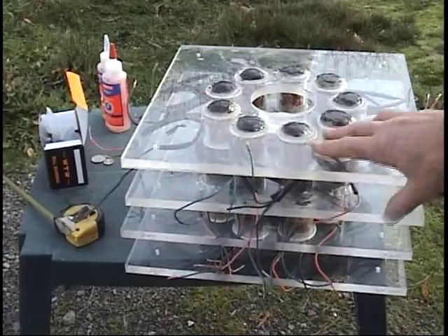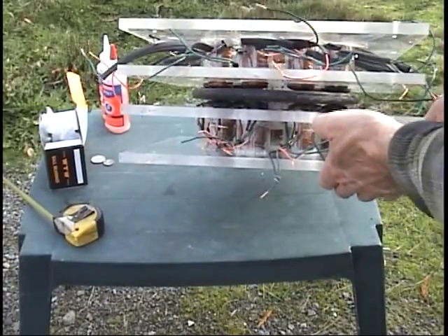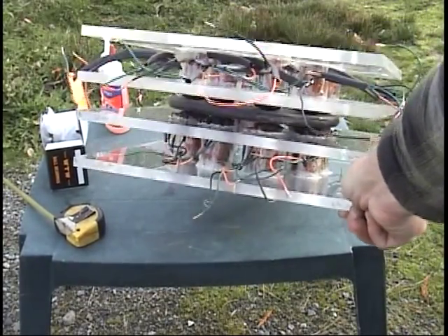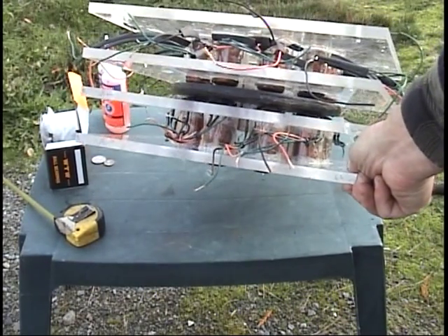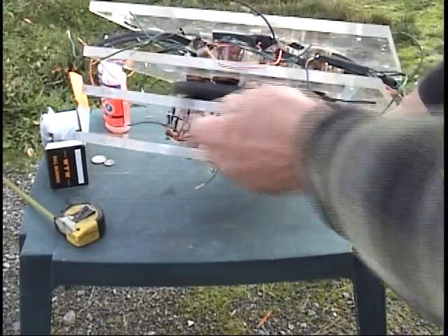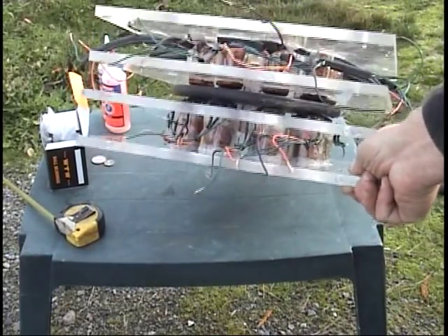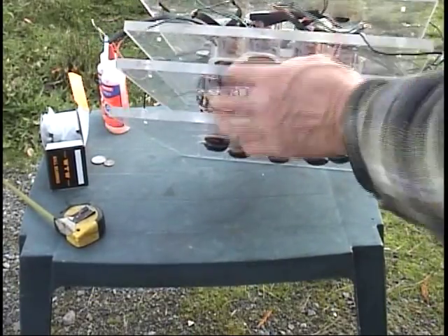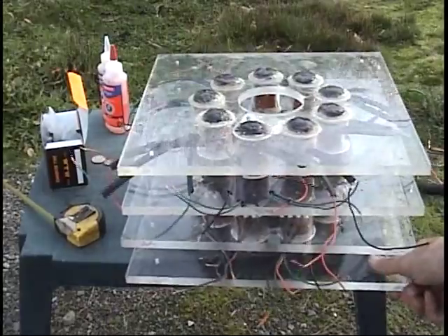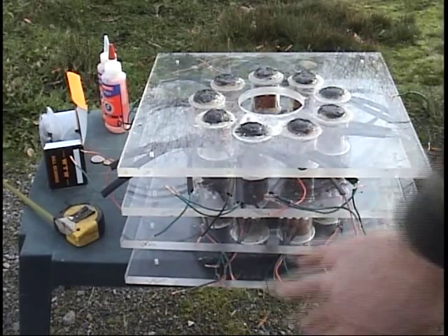Now that goes on there like that. See how they're all lined up — the magnets, the electromagnets on each side of that center rotor. So you actually send power into this one and this one at the same time, pushing on both sides of that rotor magnet at the same time when it lines up. So you get twice the force because you're pushing on each side of the magnet to hurl it around and spin it.